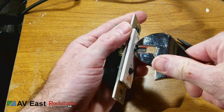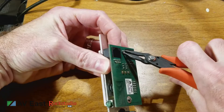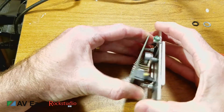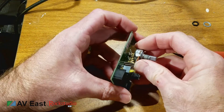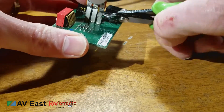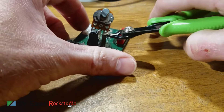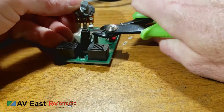First, disassemble the Zone Control device. Pop the volume knob off and use a C wrench or whatever you have to loosen that nut, flip it over and squeeze the end of those posts together towards the center, then wedge your fingers in between and pop the circuit board off the back. The volume pot is on these really long 90 degree legs, so bend the body of the pot out of the way and clip those legs off with a wire clipper. It's important to leave a bit of a stem sticking out that you can grab with the needle nose pliers. I haven't had any luck cleaning these pots with Deoxit — once they stop working they're totally done and you can't bring them back to life. You've got to replace the pot.